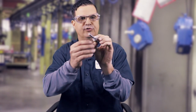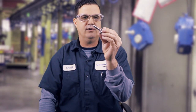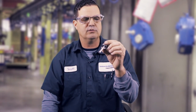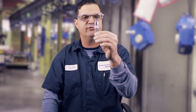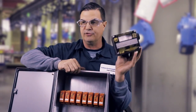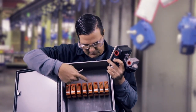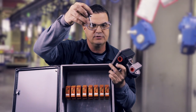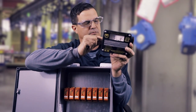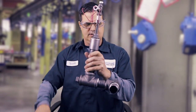This is also a type of flow switch but it's a transducer type — based on resistance, solid state. This can only be used in force lubrication just like the mechanical switch. This is just the probe itself; it has to be wired to this controller unit, which then goes to your PLC or control device. The difference: this is an electronic switch based on resistance, and the mechanical switch is built on actual liquid or air flowing through it.